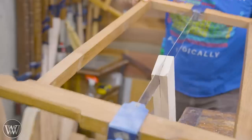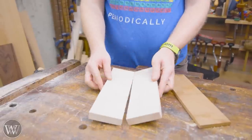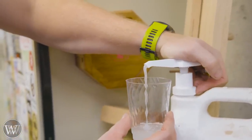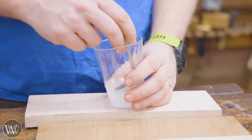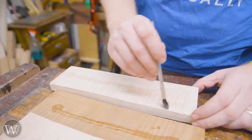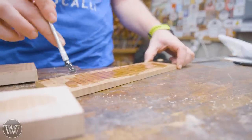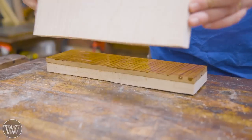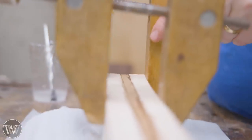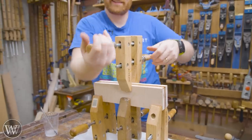It's thick enough I could have just made it out of the maple, but we're going to rip these down, cut them apart, and sandwich that torrified piece in between. I'm also going to be cutting the grain in the wrong direction technically, but it isn't a huge issue as long as you know which direction it's going. We're doing this for show — the tiger stripes will really show up far better running in the other direction. We're going to glue these together, sandwich them down, and set them aside. With epoxy you don't need to crazy squeeze them down as you do with PVA, so we'll let this sit overnight.